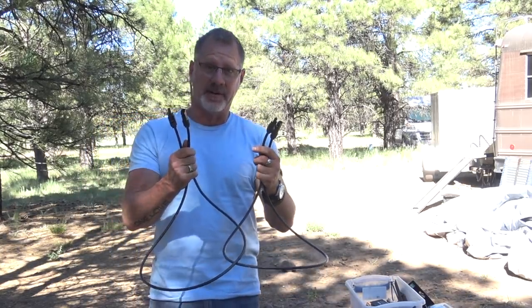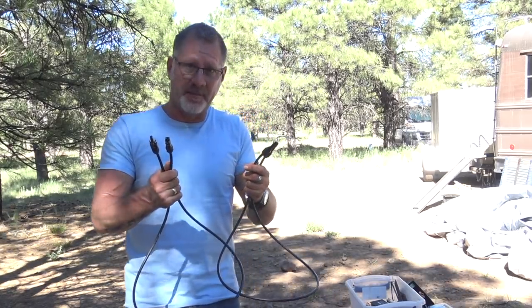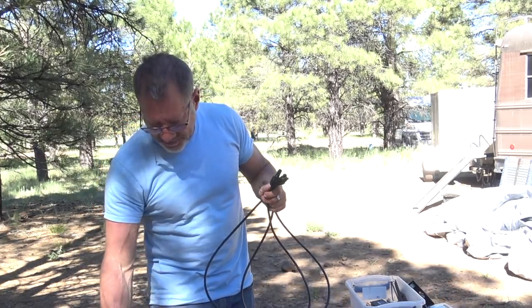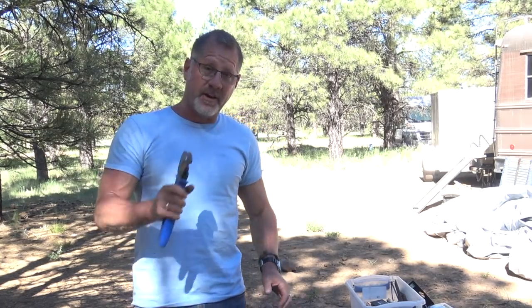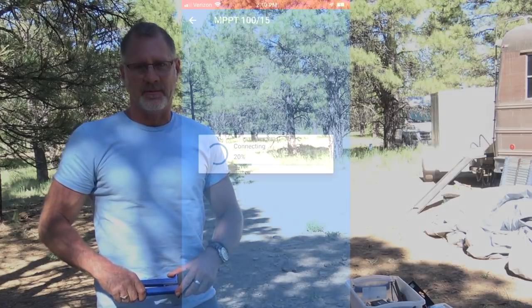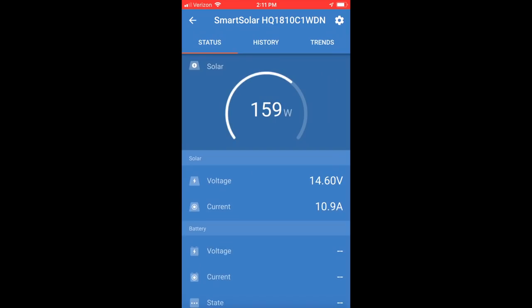10-gauge handles up to 30 amps. You want to go no less than that if you can help it because you never know when you're going to be upgrading. You're not really looking at a lot of expense in tools — these MC4 terminals aren't very expensive. Once you've got this crimper, you've always got it, and if you're out in this lifestyle it's something you come back to all the time. I hope this video helped you out. Don't be intimidated by this stuff — it's not that complicated. Get yourself right with your solar. Thanks for watching, we'll see you on the next upload.